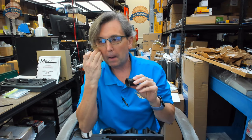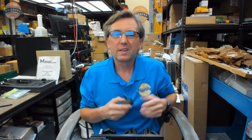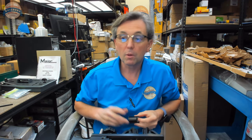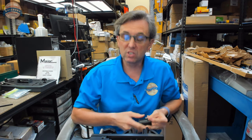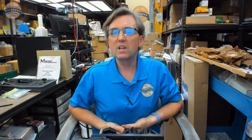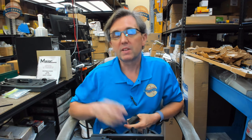Okay. If you're doing all residential locks all the time, that 7/8 will be the one that you want to use. But you want to look at the instructions of the lock, the template from the manufacturer that you're working with. 15/16 is not an unusual size to drill there either. But that barrel of the latch bolt would be 7/8.